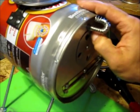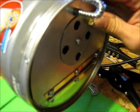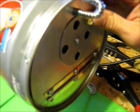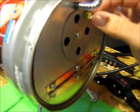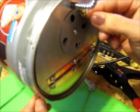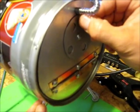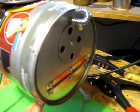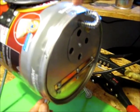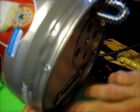I added a small piece of steel that I cut into a circular design using tin snips, and put a little tab handle on it with some Kevlar thread so you can adjust the airflow in the stove. It seems to be working well.